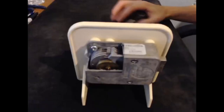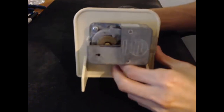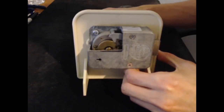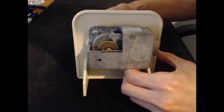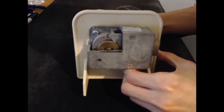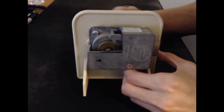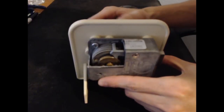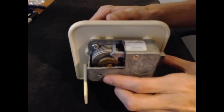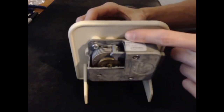The drive cam has that sort of protrusion as well. Right now everything is spinning together, but if I were to spin the other way, you can see it is only the drive cam spinning. Until I make one full rotation — then the third wheel, the wheel closest to the drive cam, starts spinning with it. After another full rotation, the second wheel starts to get picked up as well. After another rotation, the first wheel gets picked up.